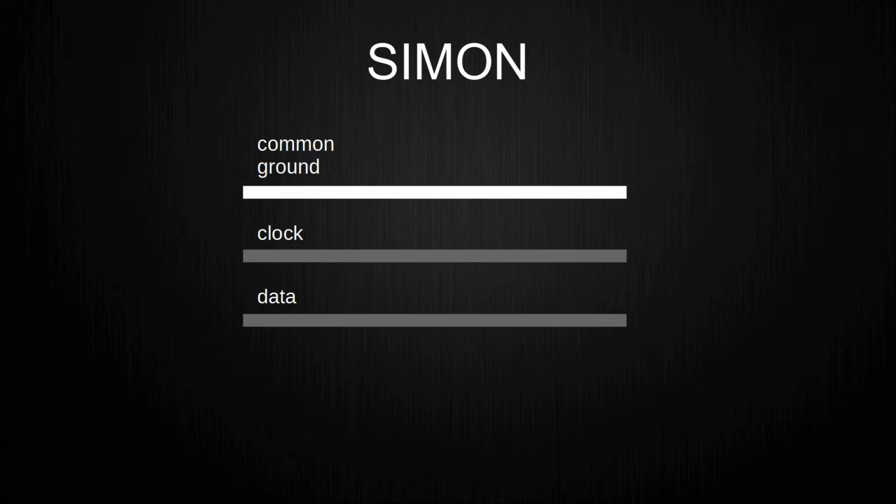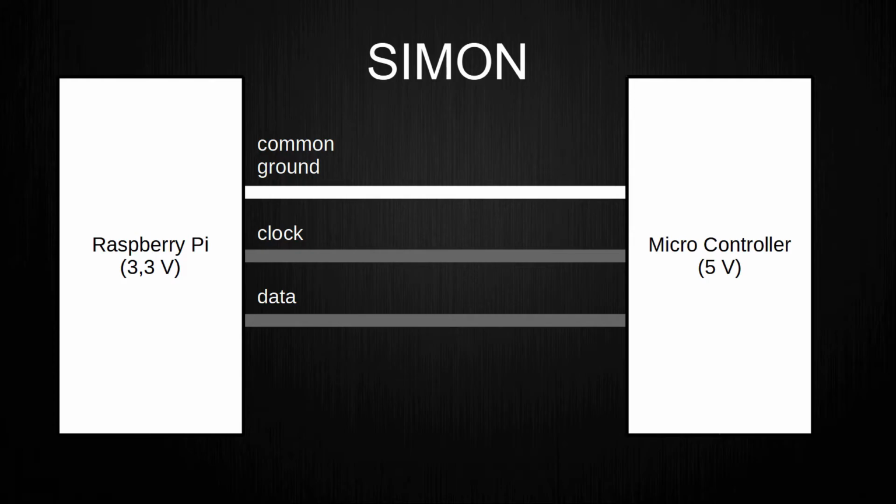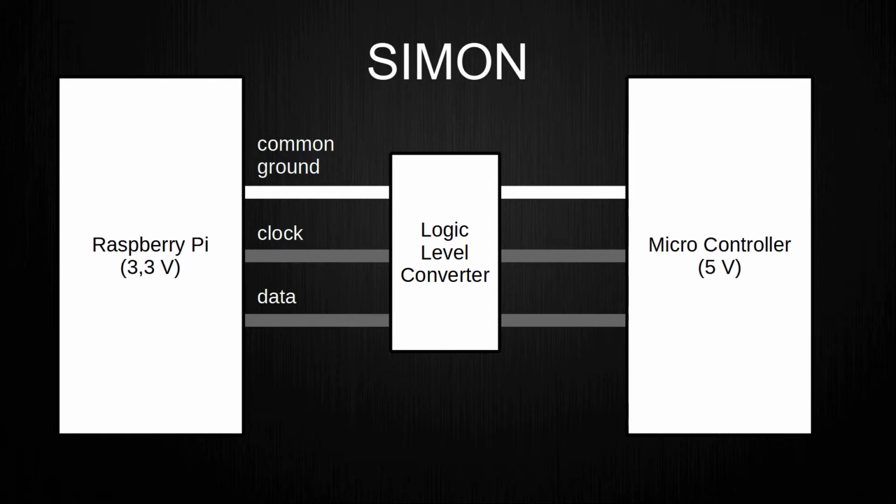In the case of GLaDOS, the microcontroller uses 5 volts and the Raspberry Pi 3.3 volts, meaning that the operating voltage is 5 volts and logic level converters are required for the Raspberry Pi. The data transmission happens with defined lengths of pulses, each standing for other states. This version is also currently used in GLaDOS due to a wiring mistake that was mentioned earlier.